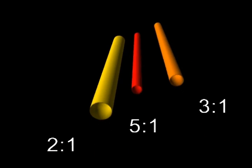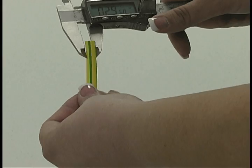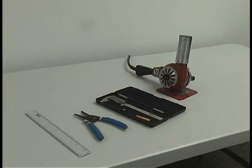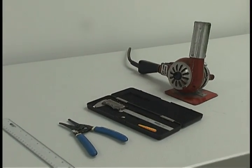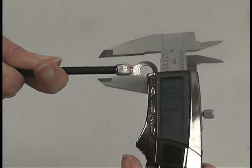Although calipers are the most accurate, there are specially designed devices available for measuring heat shrink sizes, or even a ruler will work just fine. Getting the right measurement is key when working with heat shrink — if you get the wrong size, the tubing could be too loose and slide off. To get the accurate size, measure the diameter of the thinnest part that the tube will be covering.